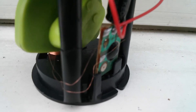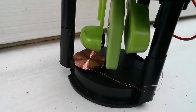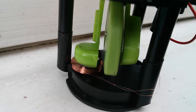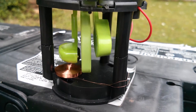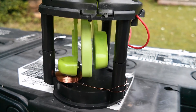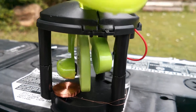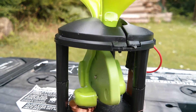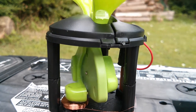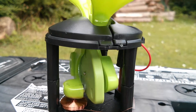Then there are two tiny enameled copper wires going down to this extraordinary enormous coil of wire. On one of the pendulum arms there's a magnet. The two outer pendula are working absolutely in antiphase with each other, so they are definitely mechanically linked and weighted the same — the one on the right is just a dummy weight. The middle one I think has a piece of metal in it so that it's dragged along by the magnet in the left-hand arm, and sometimes not dragged along — sometimes in phase with the left arm.